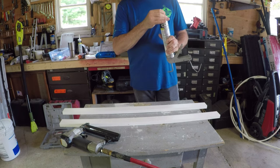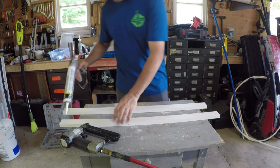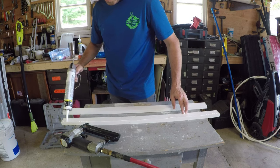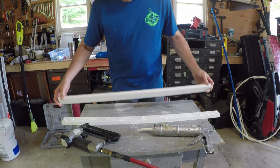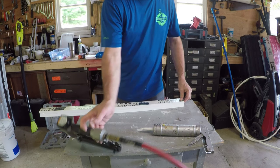In our case a little bit bigger on this one — just gluing up the two sides using simple window and door caulk, and then we're going to tack it in place with some one-and-a-quarter inch galvanized brads. Then we'll also go to the trouble of screwing this together just to make sure the pieces don't separate.